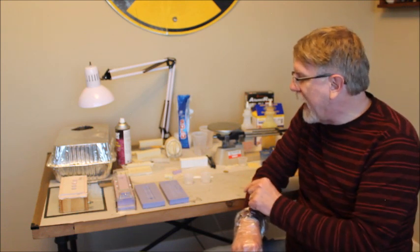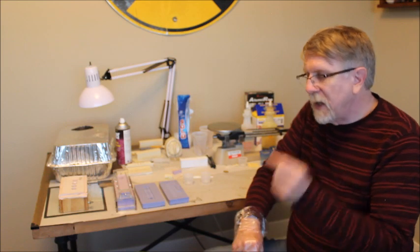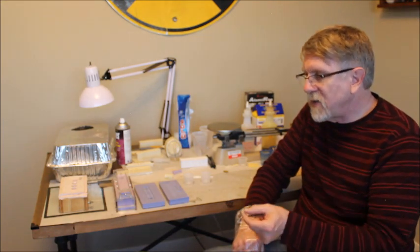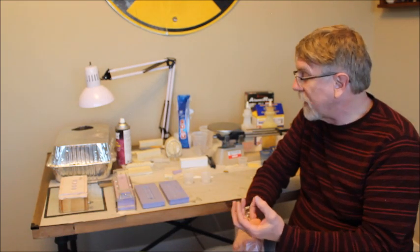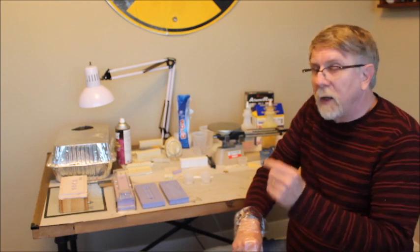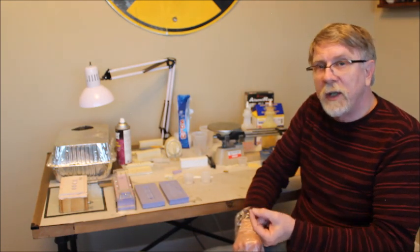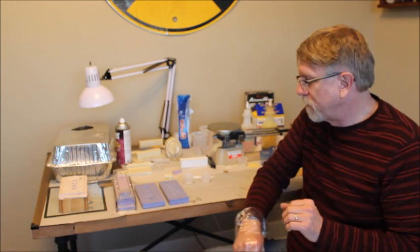If you put additives in there, it will typically add weight. It will add density. It will make the resin thicker so it won't flow into the cracks and crevices. And when you drill into it, it will dull your drills more than just the straight resin.